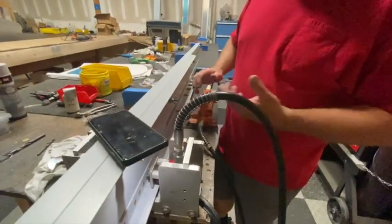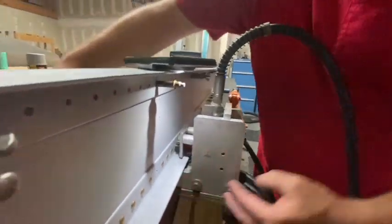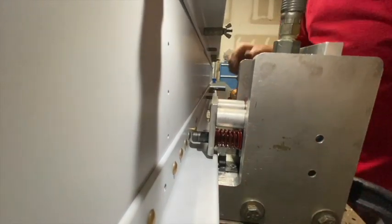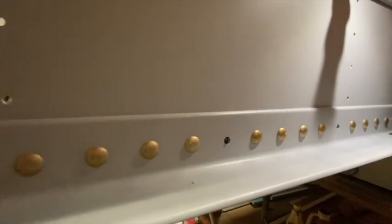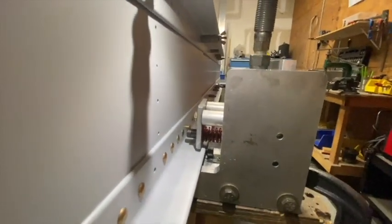Here's a view of the front side of this bar. We're going to close the valve, make sure it's all the way closed. I should mention I usually clamp this down. You're going to pull against the thing slightly, and it's going to move back because the roller can slide. Once I've got my one and a quarter to one and a half free pumps, it's tight and then I go one, two, three, four — and as you can see there isn't a single smiley face mark on the rivets. It didn't even take the cad plating off. We keep the tool very clean. The cadmium corrosion-preventative coating is still on the rivets — it doesn't damage them at all. Really proud of how this thing works.